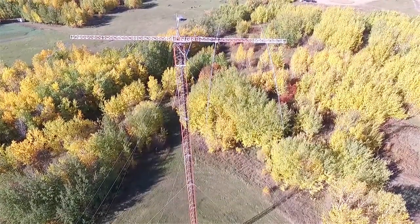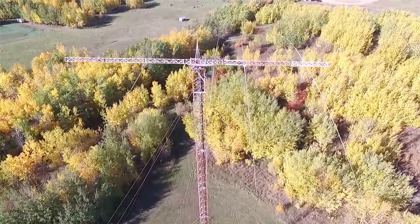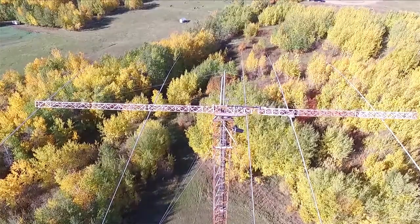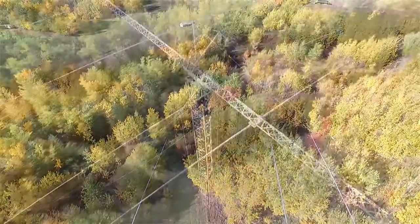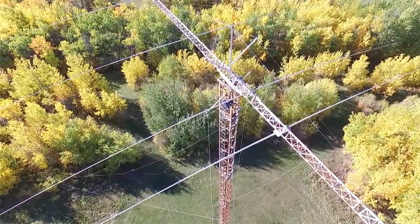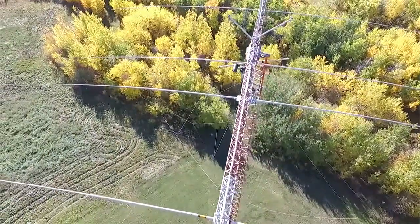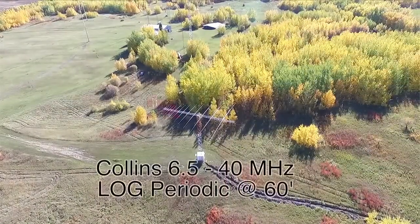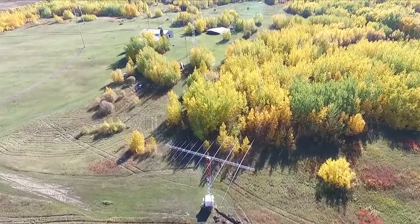The primary antenna choices from the VE6JY shack include 4 high Yagi stacks on 10 and 15 meters. He has a 3 high stack on 20. There's 5 elements on 40 meters. And there's another 3 element 40 meter Yagi, as well as a 4 element full size 80 meter Yagi. All Yagis are built right there on the farm, as are the rotating mechanisms. We'll describe that 80-meter Yagi in a little more detail here toward the end of the video.